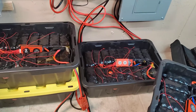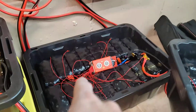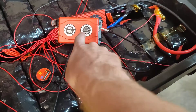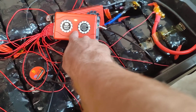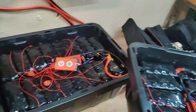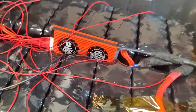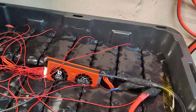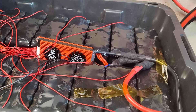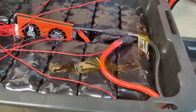What would solve all my problems is this four amp balancer. This is DALY's new active balancer — it's one amp. I've been using the DALY BMSs and I've had zero issues. But the balancing on these things is resistive — it only discharges the highest cell and only does so at 20 or 30 milliamps, which is basically useless unless it's perfectly balanced.